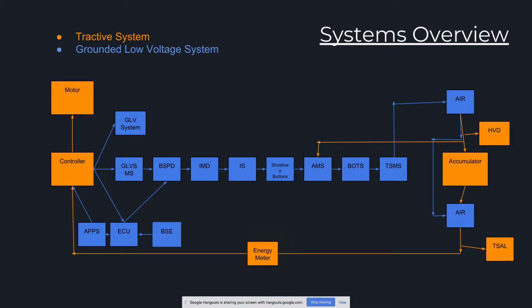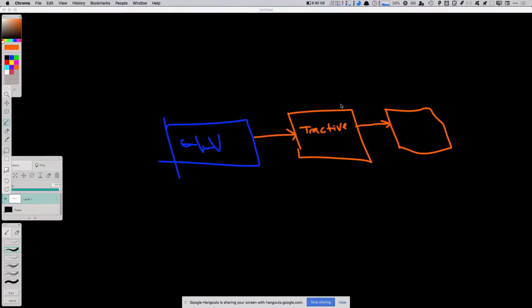There are a few different microcontrollers that you use, and some other more sophisticated teams are using them for taking preliminary measurements for things like torque vectoring and whatnot, or they'll pass off functions, they'll split it into little subunits, so that way they don't have to have everything dependent on one giant microcontroller. But ultimately, in terms of the executive decisions that are made, it all goes into the ECU, which is probably on low voltage as far as control, but it's pretty easy with transistors to step up low voltage controls for larger systems, as long as you're using the right separations, and as long as everything's galvanically isolated.